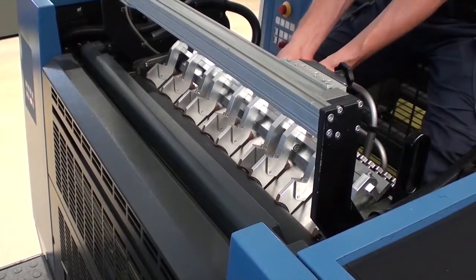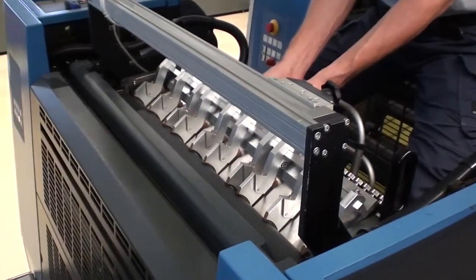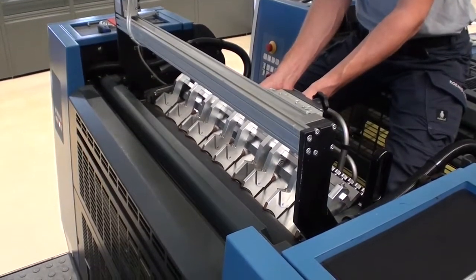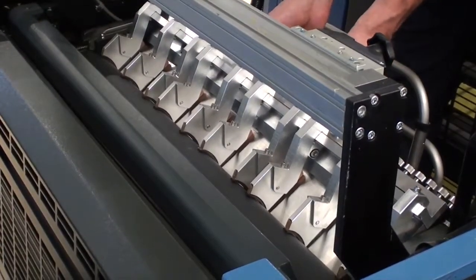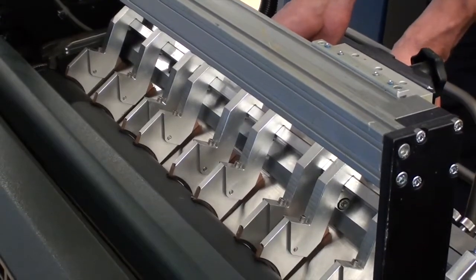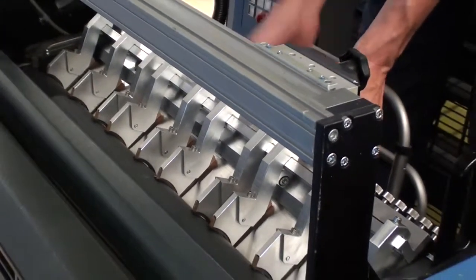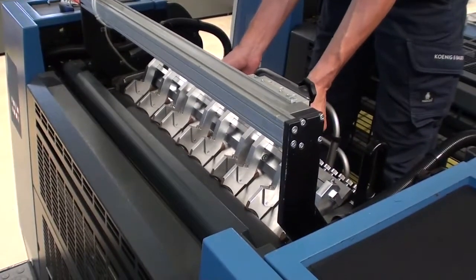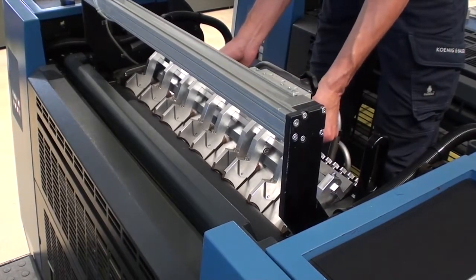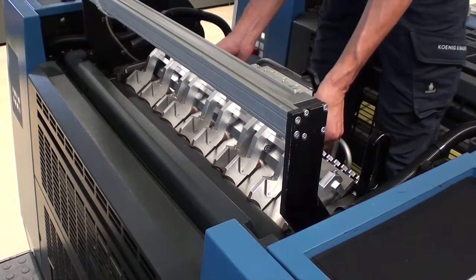So you see, the printer is now adjusting manually the ink zone screws to the knife. And as I mentioned before, in the ink tray for our purpose we have 10 ink dividers, and we always say you can add up to 15. Certainly you will have more space, but it's a question of the ink duct motor itself. And realistically, as per experience, a print company is not putting more than 15 in. If a higher amount of ink dividers is needed, we have to think about a stronger motor. The motor for Rainbow is already stronger, and it worked perfectly for 15 ink dividers.